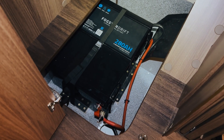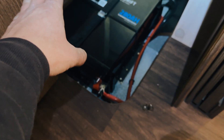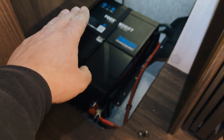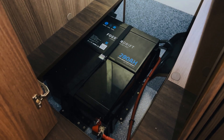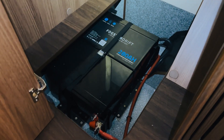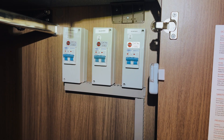The next two batteries are in here — we laid them down on their side and they just fit under here. The trouble is once you put an MRBF fuse on it, it's going to be proud of the edge. The customer asked us to make them as flat as possible so he could put a board in and close this off to use it as a wardrobe. So we took up as little room as possible — it was really dead space anyway. We've squeezed those in there: four 280 amp hour Fogstar batteries, with solar isolators for each of the strings.